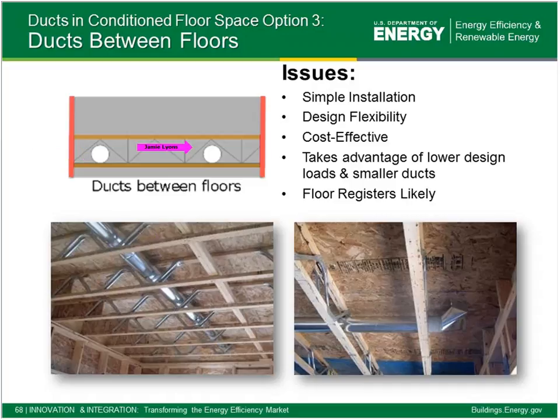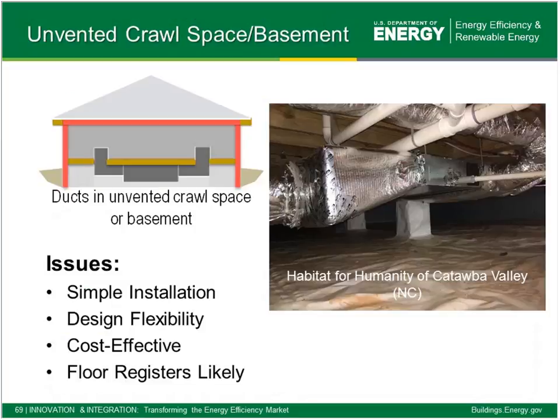If you're using an open web truss between floors, this is a very cost-effective approach. Two-story plans will end up dropping down supplies to the first floor and flying upward to the second floor in most cases — depending on your climate, that might be acceptable or more of a challenge. Unvented crawls or conditioned basements also work well. Here's a Habitat project with a ducted mini-split located in a conditioned crawl space in North Carolina — that foundation type gives a lot of flexibility in locating both the unit and the ductwork.